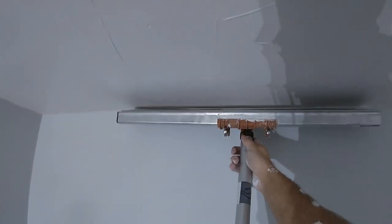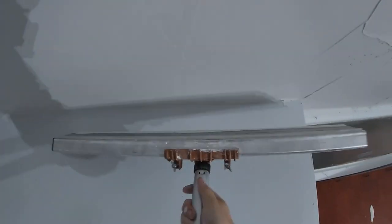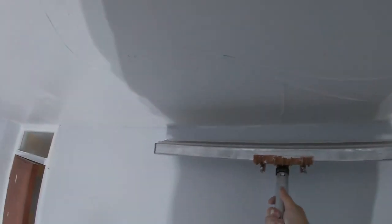You can see how nicely it's actually flattening in and keeping my angle straight. Keeping the blade flat — if you notice I'm not turning the finish back off, just mostly channelling in now. This is coming in almost neat enough where you could leave it — you wouldn't need to give it another pass on those edges with the trowel. If I can test things out and I think they're good, I'll certainly always say. Like the speed skim, if you see me using this on more videos in future you'll know what I think.